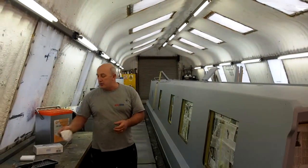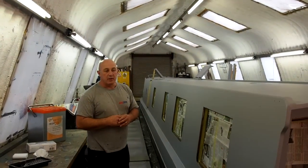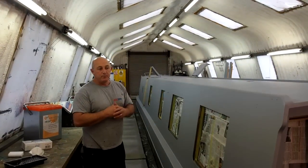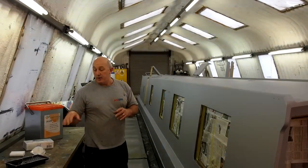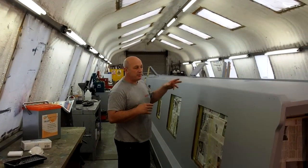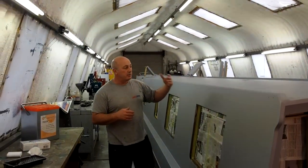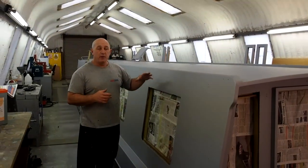So a few little tips — we'll try and throw them in as we go along during the course of the clips, so that by the time you've watched more, hopefully we'll have got you out of a few fixes at least as far as contaminating the surface. Now this boat has had its four primers, so this is the stage we're moving on now to think about undercoats. The system we use — the undercoat can be applied straight to the primer, and that's a huge bonus because it means we haven't got to rub down.